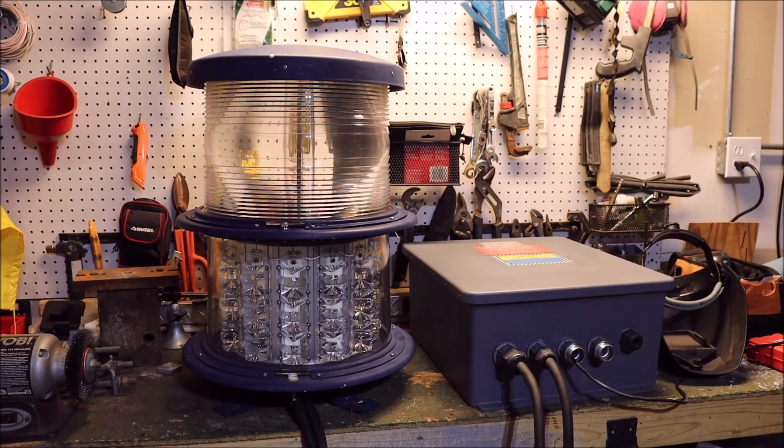Alrighty, so that was wow — that was actually really cool. You can see it on the drone — I did different angles on the camera and that was pretty remarkable. The camera had to be super far away to see it, which makes sense, because when we see this with the naked eye we're at least 500 feet away from it. Towers are tall, and these lights are used for aviation warning markers basically. The red goes on at night, and the flash we saw goes on during the day, so you normally don't see the flashes at night. There are certain circumstances where white would be more ideal during nighttime — I've seen several FAA warning lights programmed to white flash at night if there is fog in the area. That's a new function I'm not really familiar with, but that's pretty neat.